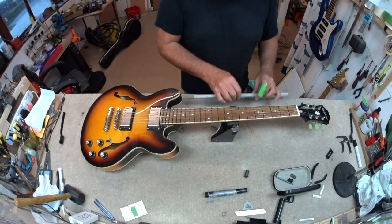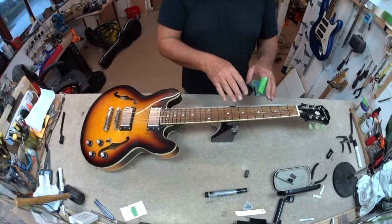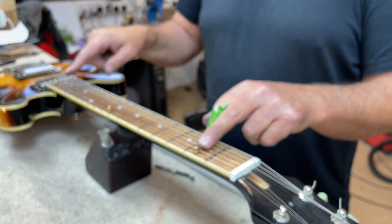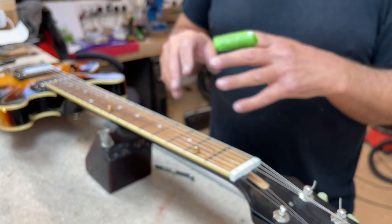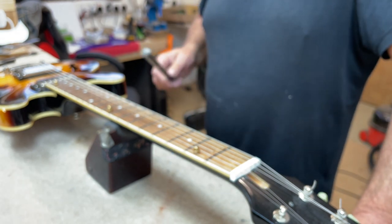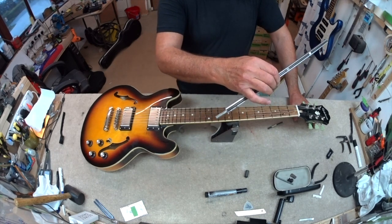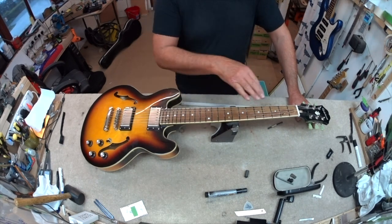That curve is smoother and more progressive and equally spaced between these three points than this actual neck itself is, right? The neck is overall the same curve, but it's full of lots of little ups and downs along the way. These three sample points don't see it. They go, it's this high here, that high there, and this high here. It's a bit like digital sampling, if you think how digital pictures work. So it's three sample points of a complex curve, and then we simplify it by mapping those three points onto a tool that recreates a smooth curve, which we know straight away is much smoother than the actual slightly imperfect curvature of this neck.